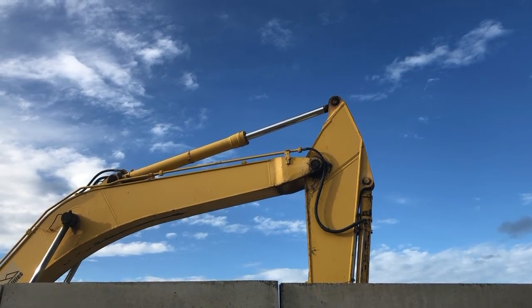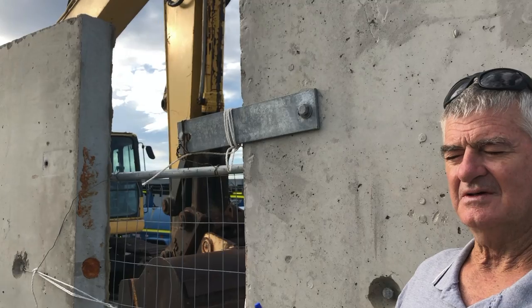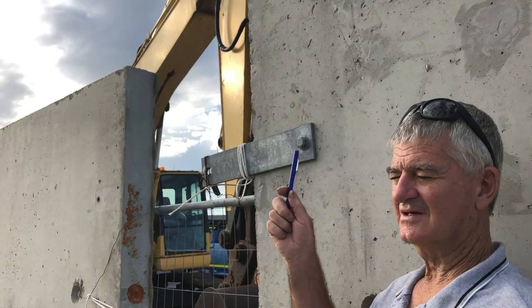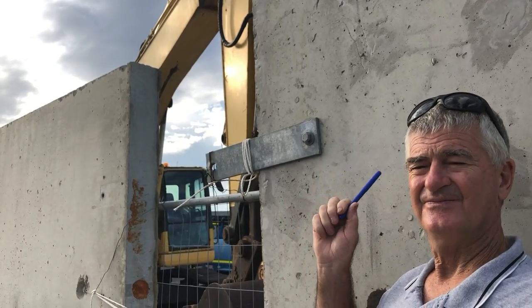So we're going to be putting a hydraulic ram in essentially the same sort of layout. You need a certain energy to lift your wing. If you've got a 6-ton limit on your ram, you've got to take that into account with your pivot ratio. Yeah, that makes sense. The ram we're going to be using is an off-the-shelf part. It's a 2.5-inch cylinder, and the stroke is variable, so you can choose whatever length you want. The safe working load of the ram we're looking at using is 6.6 ton. Obviously maximum working is going to be higher than that, but safe is, call it 6.5 ton. So theoretically we're building our arms, wings and rams all around that 6.6 number.